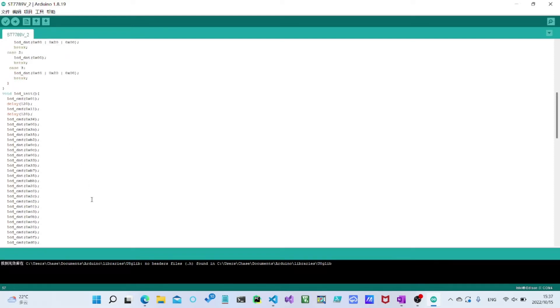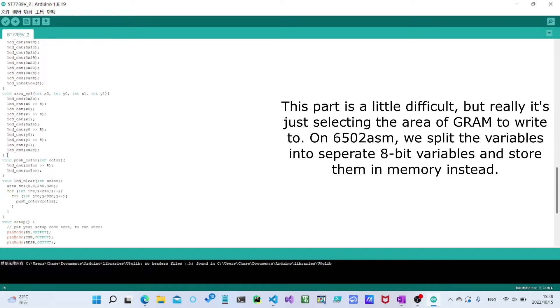The next function we have to worry about is the lcd init function. I will put the 6502 code and this Arduino code in the description. You can see we've got a couple of commands here — software reset, display enable, and then the rest are just RGB settings, gamma control, VCOM control, power control, all sorts of stuff we really don't have to worry about. One more thing to note in this init function: I've set the RGB interface mode to 16 bits instead of 18 bits, because it will be much simpler with our 6502, since it's an 8-bit processor — and 8-bit processors like 16-bit more than 18-bit.